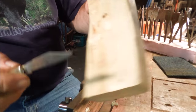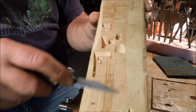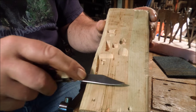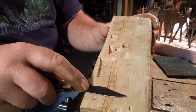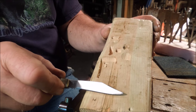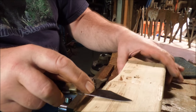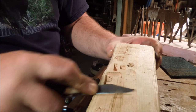You need to have it at the right angle so that it digs in and cuts. What's the right angle? Well, if the blade is laying flat, the back of the blade — or the heel — is rubbing and the edge doesn't actually have a chance to dig in, it just slides across. So we want to remove material from the back here so that it doesn't stop the blade from digging in.